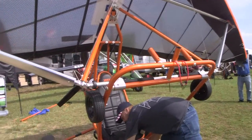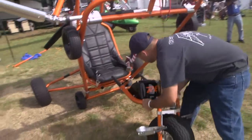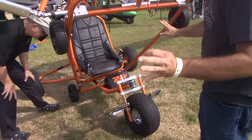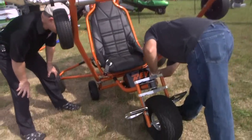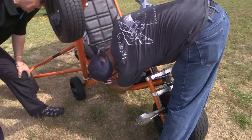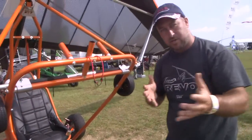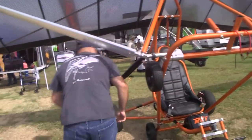You're going to pull up these speed pins — nice little pins, you just press the button and they come right out. The cart is helping hold the aircraft up in position so I can easily slide this in. There's a special technique where you can kick the tire. The material here is a tapered bit with a Delrin sleeve, designed to come in and out on a regular basis with no hassle.